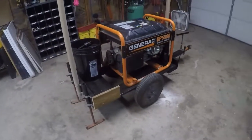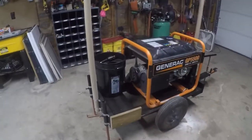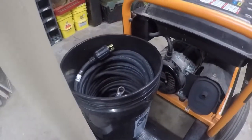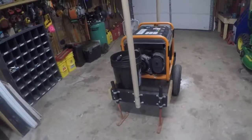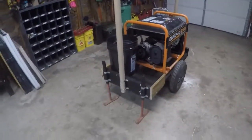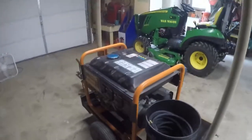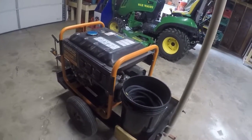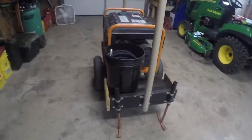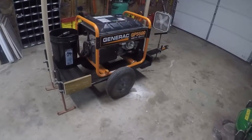The tongue does have a little flex side to side, but it shouldn't be moving side to side — just front to back and slight vibrations. I think it'll work pretty well for what I got. I'll have to get a cable so I can attach it to ground, and I'll get some stakes — you're supposed to ground the generator into the ground. I'd never grounded a generator before, I didn't even know you were supposed to. I'm hoping to get a tarp this weekend and test it out — it beats lugging it around, that's for sure.